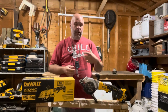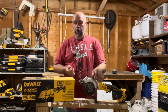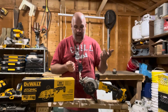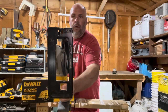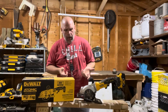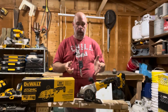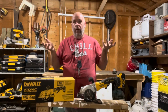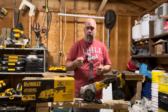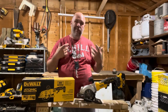The factory blade that came with it dulled up fairly quick by the time I finished one whole house of laminate flooring — it's pretty much toast now. The other downside is that the little notch where you follow the blade is really, really hard to see when you're cutting. A light on it would be super nice, but there isn't one. And I'd love a much bigger notch there — it gets clogged up with sawdust, making it hard to follow along when ripping plywood.